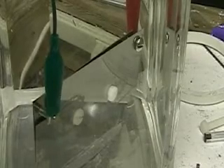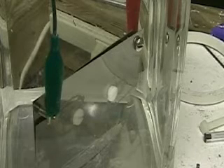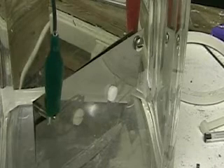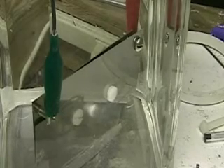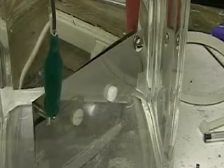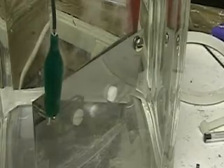This is the Aran cell with two plates in it. They're six inches long, three inches down — six by three, spaced an eighth of an inch apart, positive and negative, the same as the other. We're going to hook it up. It's in the same distilled water, same battery — the battery's going to be a little weaker, matter of fact. Set it up now and let's see what happens.